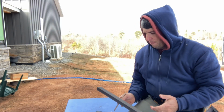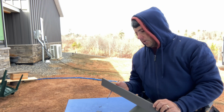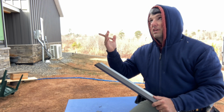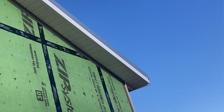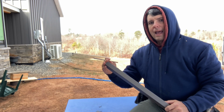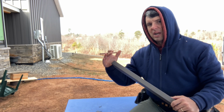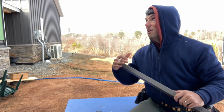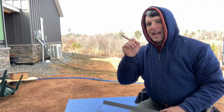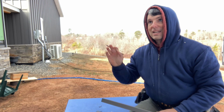With these steel trim pieces, you can be as fancy as you want to your likings. Since these pieces that I'm doing now, these J-channel pieces, are up underneath the eaves, they're not going to see any weather. They're never going to see any rain. So I'm not concerned about overlapping the pieces and transitioning into each other. So I'm just butting them together, and I think that'll be fine. You're never going to see those little teeny tiny gaps in between them. By the time I get the steel panels up there, that's all going to blend in and you'll never see it.